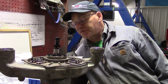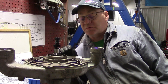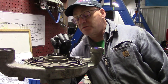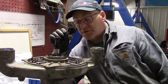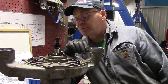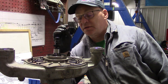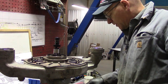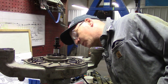Somebody pointed out this engine is 50 years old in about a week, and it's probably been sitting in water or something. We may find heavy corrosion on the inside. We just broke two of those machine screws - they're special too. They're so thin, I can't believe that much torque is on there. They may have been over-torqued when assembled, but I doubt it - I think they're just stuck in the threads in the diffuser scroll. We'll have to do really good cleaning of those threads. We'll have to extract those two bolts somehow - maybe weld a nut on there. I hate breaking fasteners but there was nothing else I could do. You can't even get in there with a torch, and plus it's magnesium alloy - I'm not heating up a magnesium alloy case with a torch.